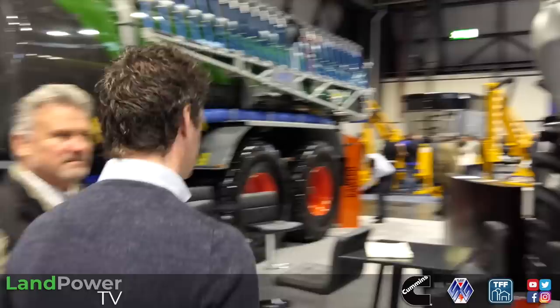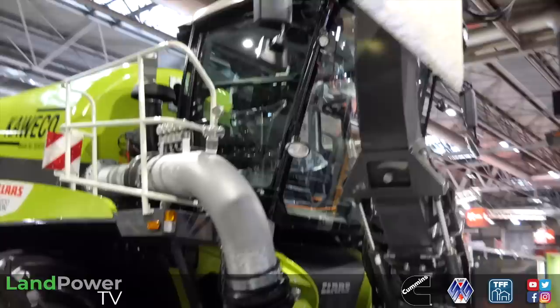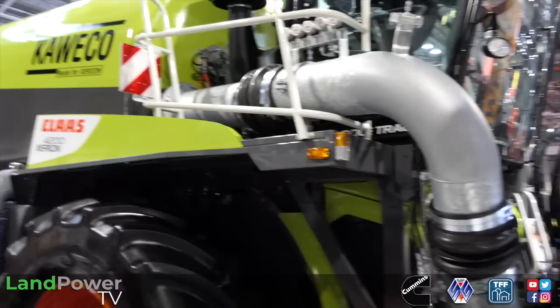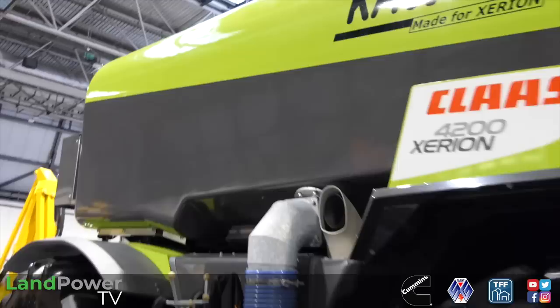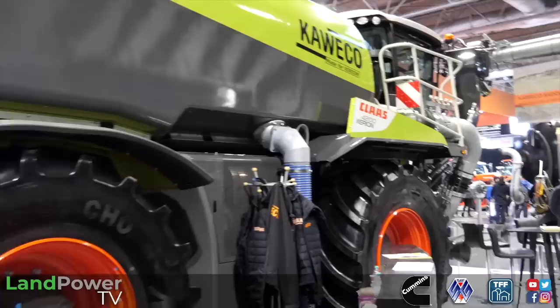With Britain in the AD thing and big biogas plants all over the place - what makes this machine specifically different from competitors? Mainly seeing its capacity. It's a machine with a 9 or 12,000 litre pump on the back. A big benefit is we have a complete front unit where we are very versatile to fill the tanker at all positions - a full 180-degree sweep. We can drive up to the end of the field, go over to the road and then suck a nursing tanker empty. The entire tanker front unit system we build and mount on the Xerion - CLAAS delivers the Xerion to us, we mount it, and it goes to the dealer then to the end customer.